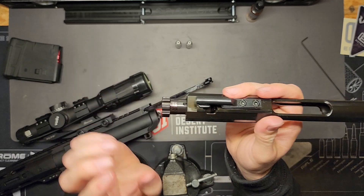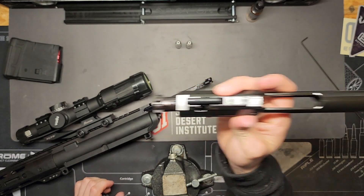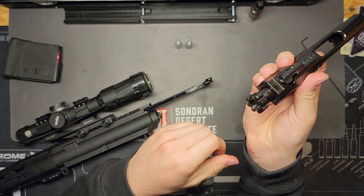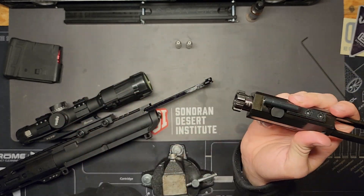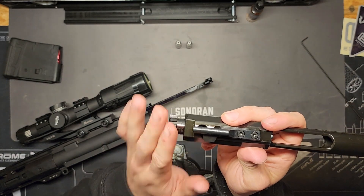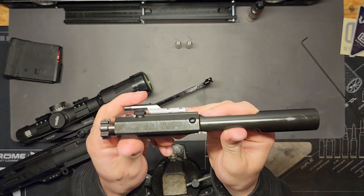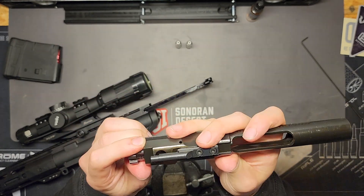So if you look at this bolt here — the way it's sitting when it's forward, this is the configuration the bolt carrier group will be in when it's traveling inside the firearm. If I press on the firing pin, it's not going to protrude out of there. Even pushing it back a little more — still not protruding. But when it's fully locked in the most forward position, the round is chambered, and the lugs are engaged with the barrel extension — then the firing pin can go through. Those are very small tolerances that go into the machining of the bolt carrier group — where the firing pin retaining pin is, the cam pin, the bolt — everything that allows that to happen. That's timing, in a nutshell.